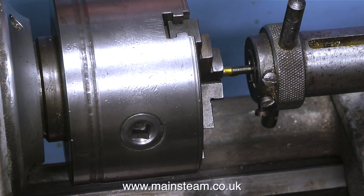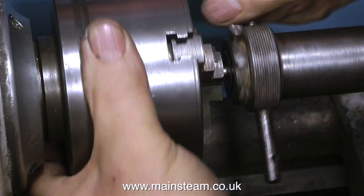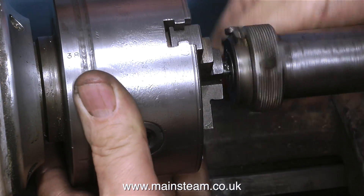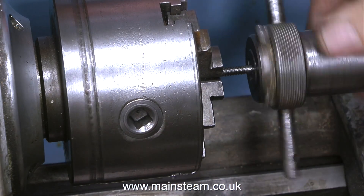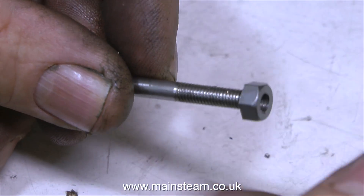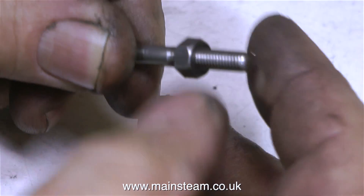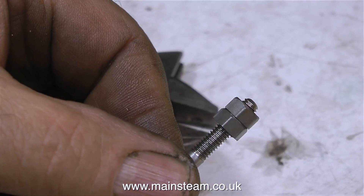Then all you have to do is wind the freshly cleaned die down the existing thread and cut the last quarter of an inch — quite simple really. I'm fairly confident I'll get lots of comments on this from experts, and yes I am aware there are many different types of die holders and dies. Please be aware that I make these videos specifically to try and help beginners in the home workshop, not to compete with major industries. And here we have the end product: a really nice thread that takes the nut without any shake whatsoever — a good quality thread that will not strip if you put any pressure on it and will last a long time.